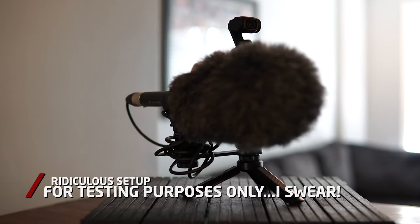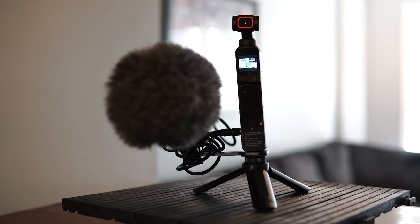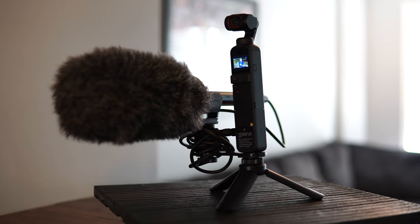So now I've saved the best — or maybe the most expensive — for last when it comes to my shotgun microphones. This is the Sennheiser, part of the 600 series. I use this for a lot of professional work. It's a great shotgun mic — you can use it on a boom pole, you can use it for interviews. It does take a battery, so you have to be careful: if you don't turn the microphone on, you won't get audio on a device like this. If your device has phantom power, good — but the Pocket 2 does not have phantom power. So you're going to need a battery, and hopefully it's going to give me really good crisp sound. I have it hooked up through the audio port using the 3.5mm jack. It also connects via XLR, which I normally use with other larger cameras. I don't think I would use this on a normal shoot with the Pocket 2 because this microphone is way too big and it kind of looks funny on the Pocket 2, but I want to give it a try.